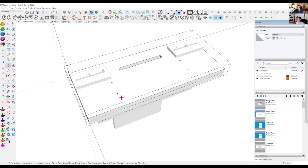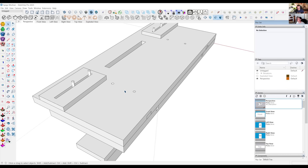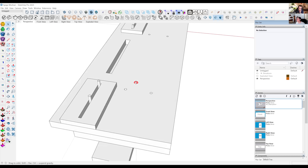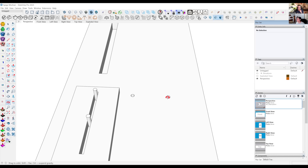One of the tests I'd run in the shop is to cut a couple of groove slots, use their hardware, and check: pushing it forward and back, how hard is it to move with four of these things in play? Do they torque in position or will it run true? If that's not enough, we can fall back on the runners. We also want to make sure the hole is set back far enough that it's not going to interfere with any mortising, and that two of them are far enough apart to both occupy that space.